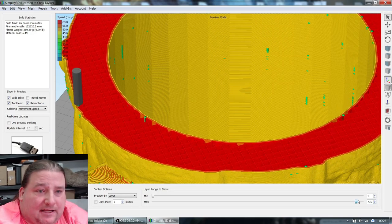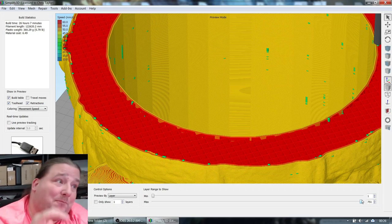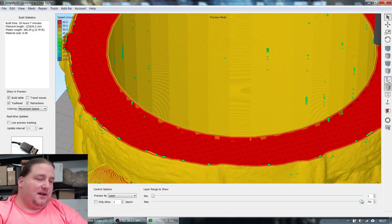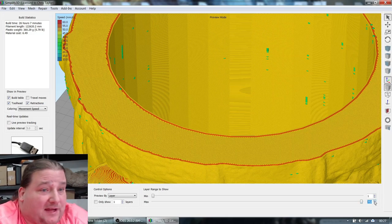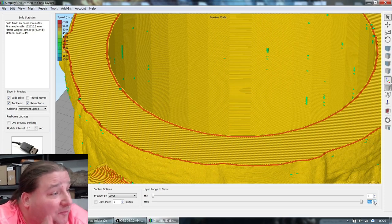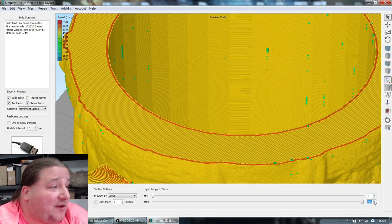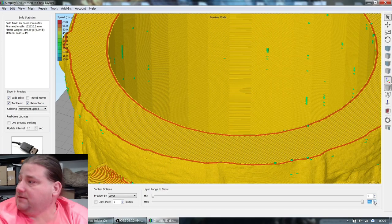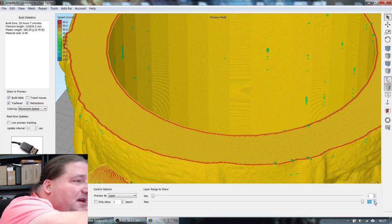The result is that when you reach the top layers, the model also has structural integrity at the top — where most people grab a pot, either from the bottom or by the edge. And then that's it: you have something solid to print your top layers on. Even the first top layer will be almost perfect because of the 25% support infill underneath it, and with four top layers you have multiple chances to get a nice clean top surface.